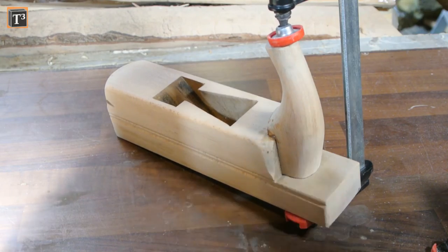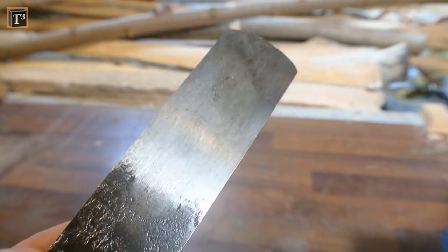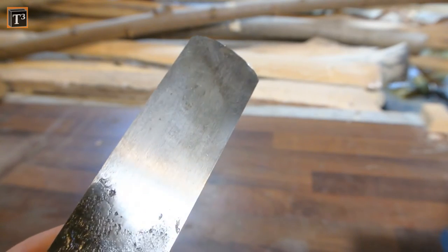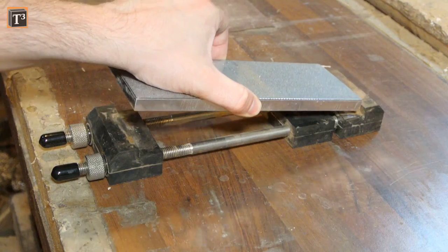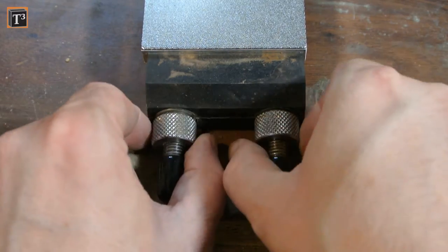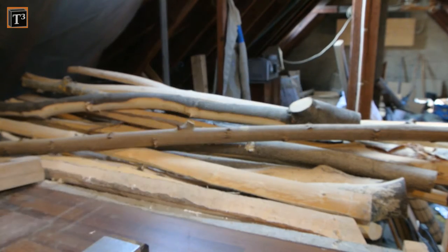This gave me time to take care of the iron's back where you can still see the factory marks. Usually you need to get the back really flat once in a tool's lifetime if you want a really sharp edge. If you are using sharpening stones you could use a wet towel, but a special holder works best to keep my diamond stones in place. As such an initial flattening can get pretty messy, you may want to wear gloves.